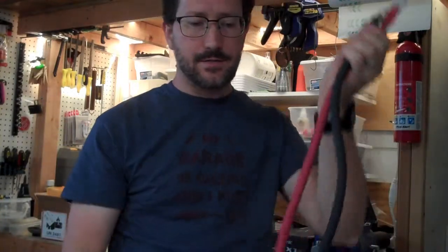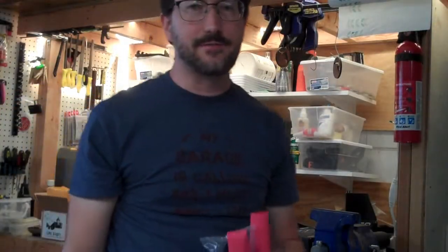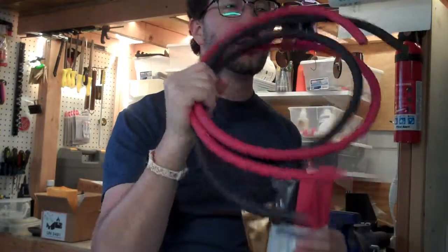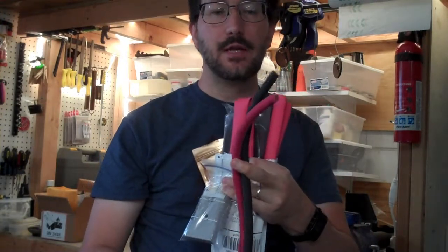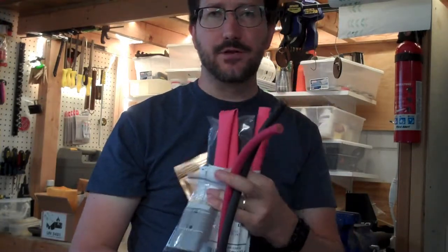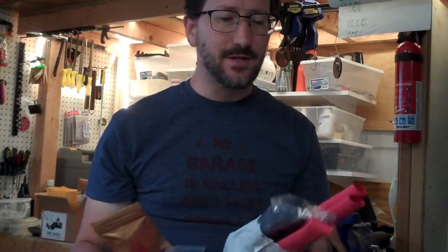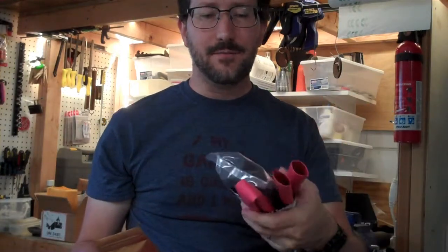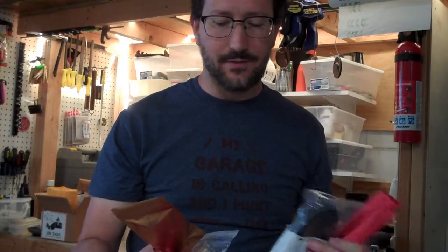For the inverter, these cable lengths are exactly the same length and it has the plug I'm going to plug into the battery. On the battery side, I'm going to make my own. To do that you need lots of separate purchases. These are a couple of feet of 1/0 single-zero welding cable. I got red and black just to color coordinate everything — I like having things correctly identified by the polarity of the DC current. So I got red and black glue-lined heat shrink tubing.